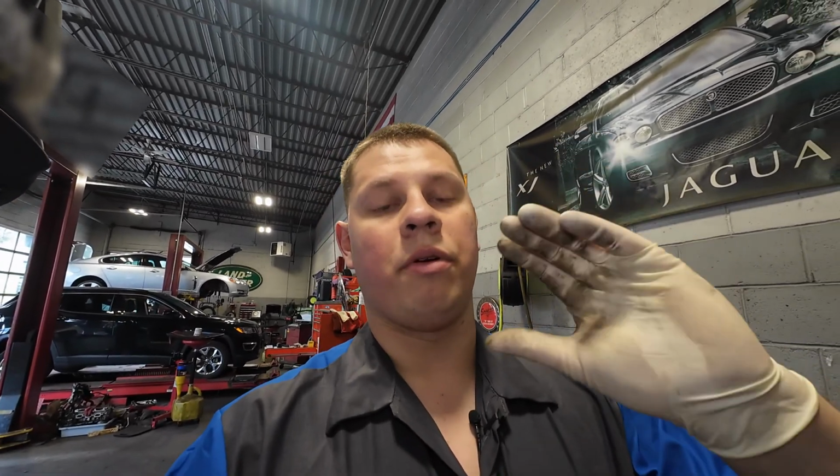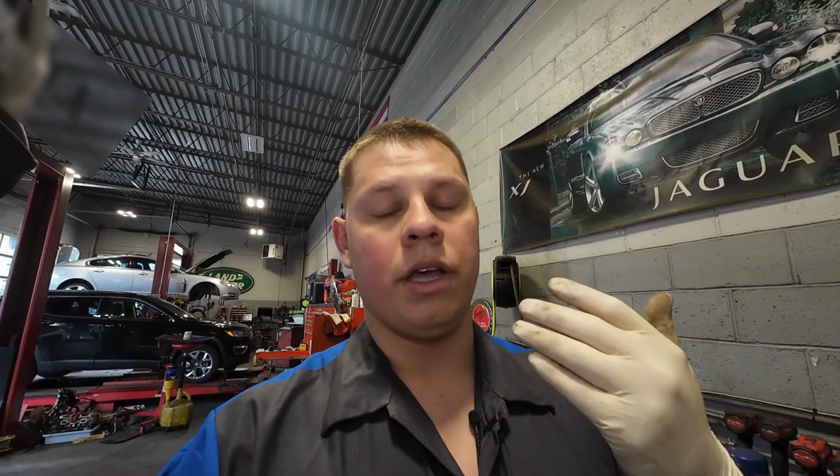So now you just saw how much metal particles hit the face shield when you're cutting something. Obviously, I was trying to demonstrate it at a certain angle, but trust me, whenever you need to cut something off, that's when all the stuff is hitting your face. Of course, you can regulate the cutoff wheel to prevent most of the particles coming into your face, but that still is not a 100% guarantee.